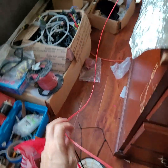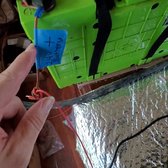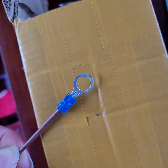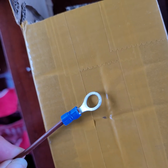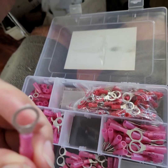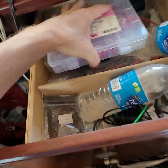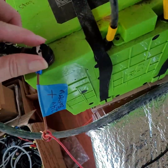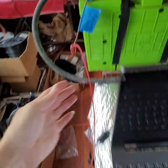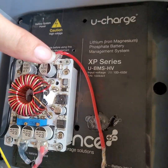The only other wire coming out of here is this red wire, and it's going to 24 volts positive. I twisted it because I don't know how long you want that wire. I have a pile of these already crimped onto the wire. I gave you these heavier ring terminals instead of a standard crimp because these are actually much thicker and stronger. If you're applying all the force of a bolt holding down a big fat wire through a ring terminal, you need that to be strong. This red wire is actually fused inside here — sometimes I throw an extra fuse on it, but it's not really needed.